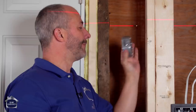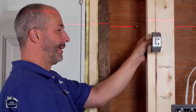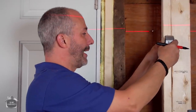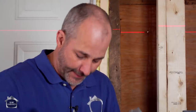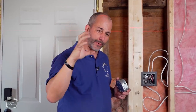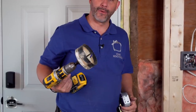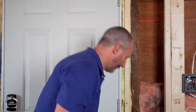Here's the secret: if I go too deep and I'm behind my finished surface, and because it's vinyl siding, I'm going to collapse all of the vinyl siding. So I really want that perfect. We have three quarter inch wood on the outside — it's going to be really hard to drill just three eighths out. So what I'm going to do is take the whole three quarter, and then pack in behind with a little something to get this raised to the right surface. I'll put my tip in the same spot as the hole I just drilled, and that'll work out lovely.